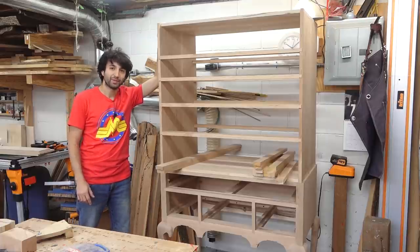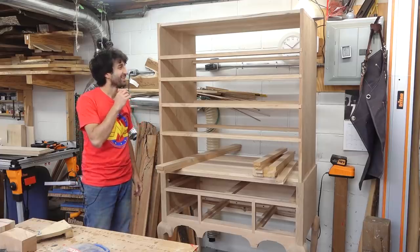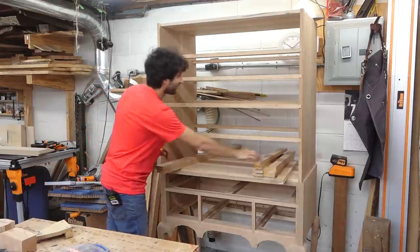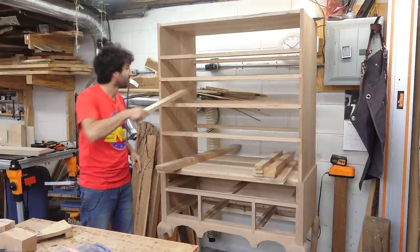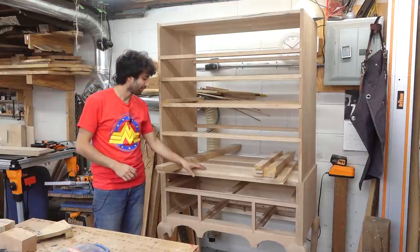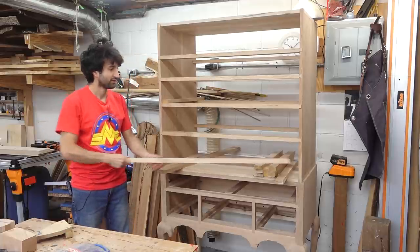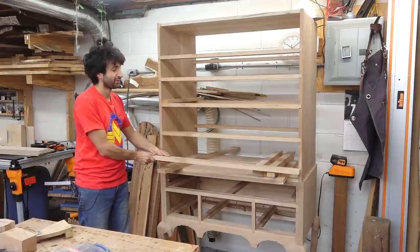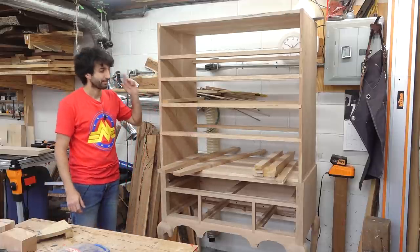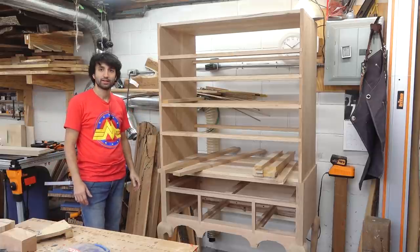I'll never see them together finished in the shop, just like when I built the secretary desk. The next couple of things on the upper case to wrap up the framework for the drawers is to add the runners, and those get mortise and tenon between the two drawer dividers. There's also a false bottom that goes on here — it gets cut to size to fit between the two sides and that'll get glued down to the bottom panel.